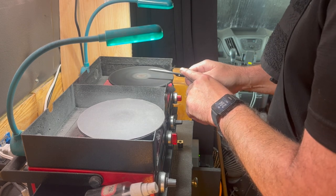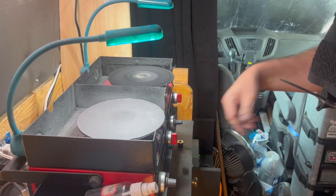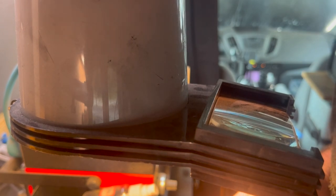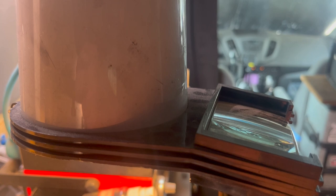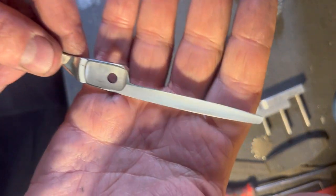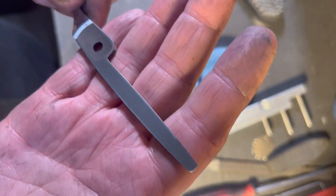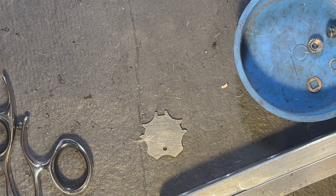Now I'm going to shut this down and reverse the wheel in the opposite direction to dull out the inside of that blade. I know that seems counterintuitive for a sharpener, but you need that blade to have a very slight radiused inside edge so that when it comes down and does its cut, it's not going to ram into those teeth. You can see where I had to dull that inside edge right up on the top of the ride line — that's going to allow those sharp teeth to pass over this blade without damaging them.